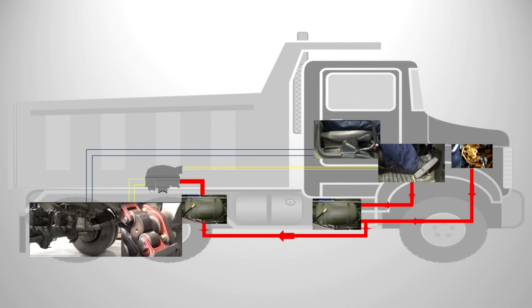When the driver applies the foot brake, the signal pressure is sent to the relay, which in turn uses the compressed air in its own reservoir to make that same application to the rear service brakes with the larger pipes, minimising the brake lag. And on releasing the foot brake, only the signal is exhausted from the foot control valve, while the main air used to apply the rear service brakes gets exhausted through the relay. And that's how we've solved the problem of massive brake lag with a relay.